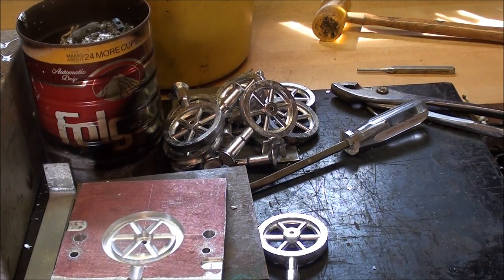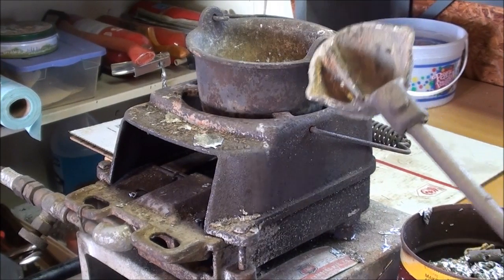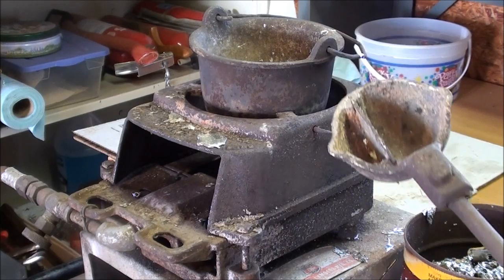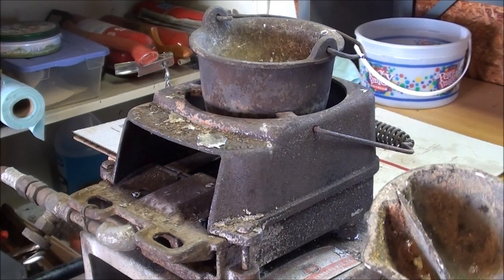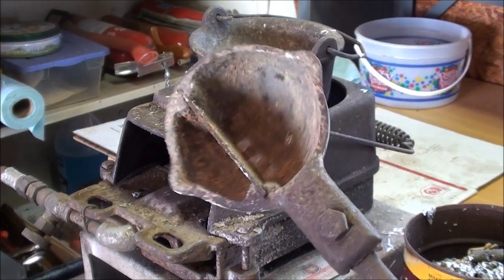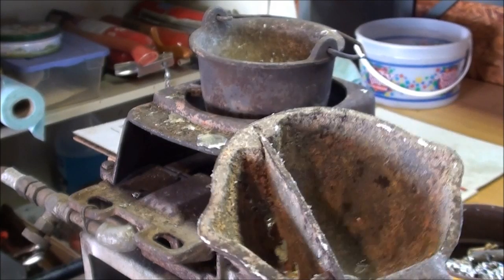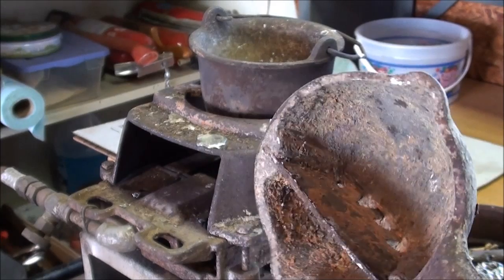Shopdog Sam, settle down in the front row there, will you please? I just let the balance of the lead solidify in the iron pot. I've never had a problem with it cracking. The problem would be when you put it away for a year and then restart it — the lead may expand, but it doesn't seem to do that. Since there's no top on it, the expansion can be upward. But I don't leave the ladle in there. This was a bottom-pour ladle, so you notice that I didn't really have to scrape the dross each time, because the metal going into the mold is basically coming off the bottom of the ladle. Pretty slick.